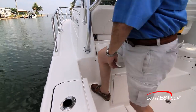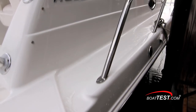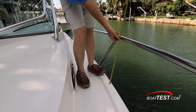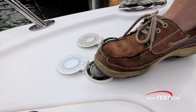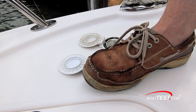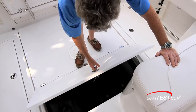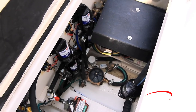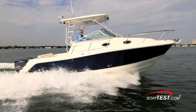The bow is accessed from side decks, and should the R305 take any water over the bow while offshore, it quickly gets directed overboard. Rail height at the windshield is 18.5 inches, rising to 22 inches at the working end of the bow, where there is a standard windlass with foot controls to the side. Mechanical equipment is in a spacious compartment at the forward end of the cockpit, easily accessed through a hatch, revealing a fiberglass hull with a finished stringer system. A Kevlar strip down the keel protects the bottom from underwater objects.